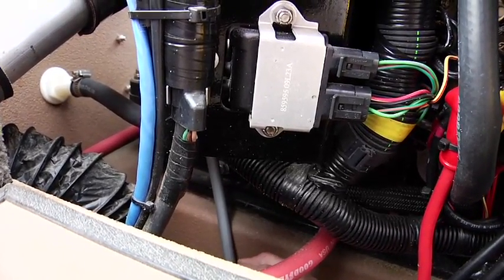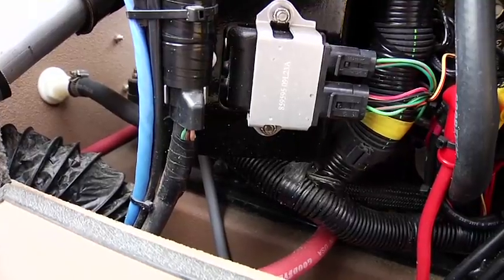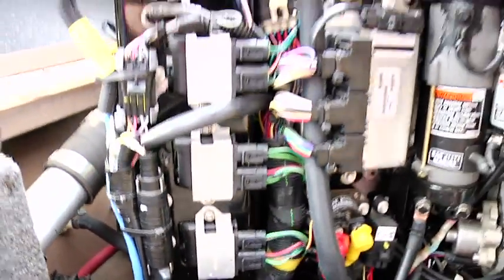Put your Prestone fittings back on your heater hoses, double check your sand trap, make sure it isn't broken, and you are ready to go back in the water. So it's a simple system. We've incorporated the emergency water exit bolt, which is really handy, and I think we're the only company that does that. But it does prevent a lot of headache down the road, because that will happen to a boat that doesn't have it sooner or later if you live in a northern environment.